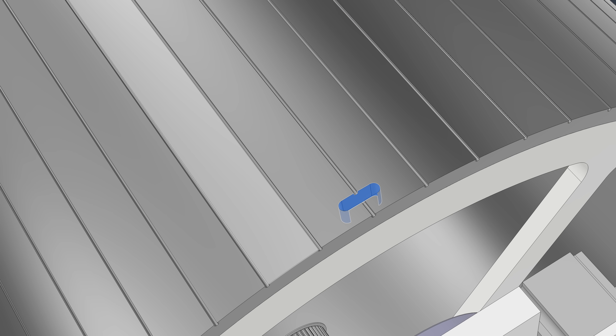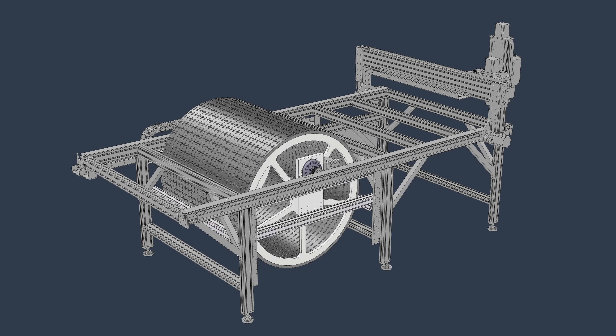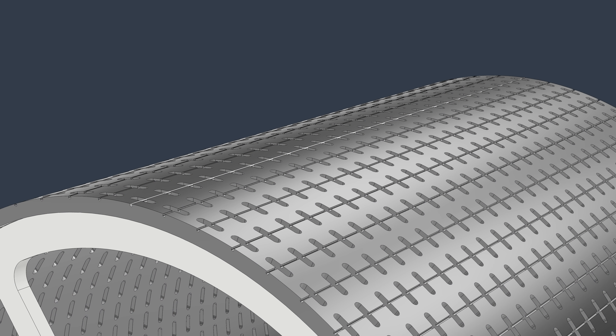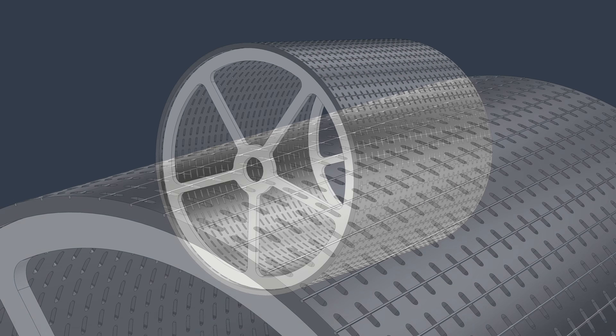We use a straight mill to cut a perpendicular slot across the first slot, and this slot will position the programming profiles sideways. The precision of these slots is very forgiving — they only need to be kind of precise on their sides, but the length does not matter at all. So this is also a simple machining operation for the rotary CNC, and we can easily cut all the slots across the entire wheel. Lastly we cut metal bars to length and push them into the wheel — the bars will be press fitted in place, so no need for glue or anything like that.